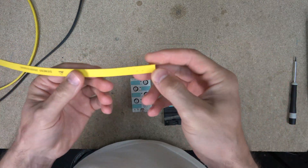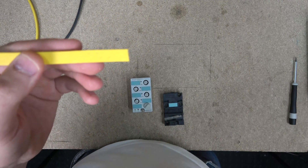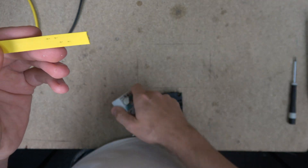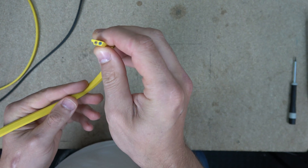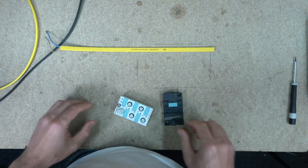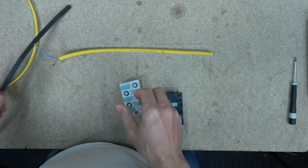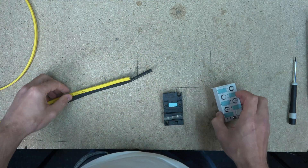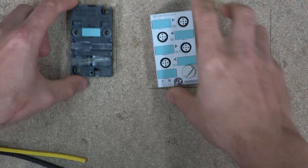The material of the actual cable is rubber - a really interesting rubber. Siemens likes to call it self-healing. As you can see, once you remove the pins, it sort of self-closes and no water can penetrate - it's a really good standard cable. Inside there's just a brown and a blue - nothing crazy. The yellow cable is always used to power your inputs, the controller, and for data transfer. The black one is your auxiliary power which will power your outputs.